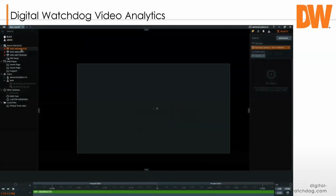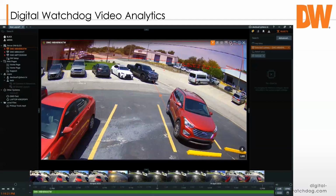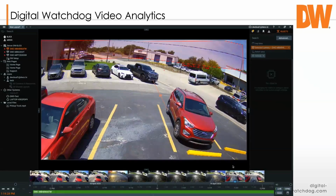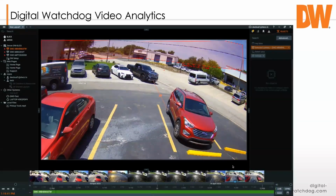All right, video analytics. We have cameras that have video analytics built into them, and we released several at the show too. The Blackjack CX can receive the data and use it for activating devices, like turning on an illuminator or sending out a notification or warning. What's coming from our cameras and other manufacturers' cameras that have analytics is called metadata. We're reading the metadata and then having the system react to it. It might be as simple as sending out a notification or making a screen pop up. But the CX works the same way as the Spectrum that you're used to running in Windows.